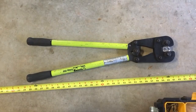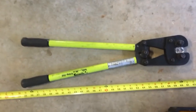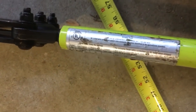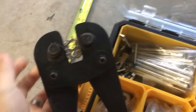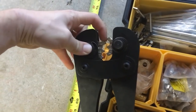So after crushing all your DIY battery cable dreams, I don't want to be a dream crusher without a solution. Here's my Quick Cable Crimp 250 — this is a UL-listed battery crimper. It has the UL tag on it. It tells you which size lugs to use on which size wires. It has rotating heads — you pop it open and can rotate to the different sizes of the crimp die.